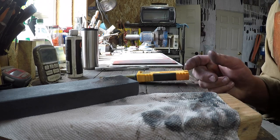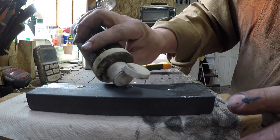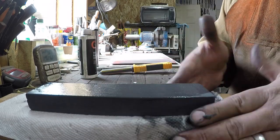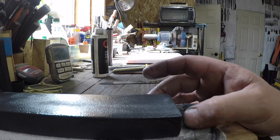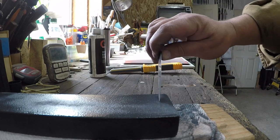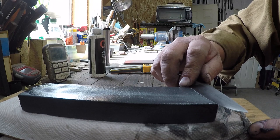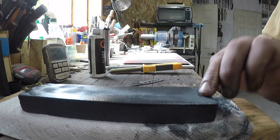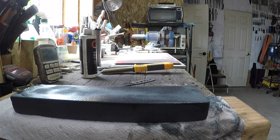That didn't take but about 17 minutes total - not very bad at all. Now let's throw some oil on here and see what we did to our stone, because the knife and the stone are a package. There is a little bit of a low spot here now, and there's a little bit of a gouge where I was really getting after it to get the beginning of the damage out. But when you go to sharpen you're going to start just on the edge of that hollow spot and take your stroke. As the rest of this stone wears down to meet that, you're actually getting use out of the ends that you wouldn't normally get use out of.